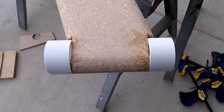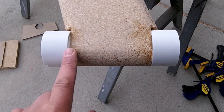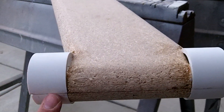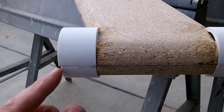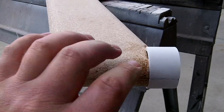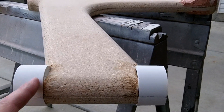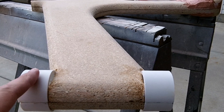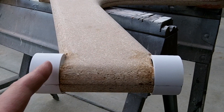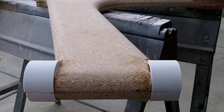I've got the head tubes on there. I've tacked them with just some super glue and accelerator, just on the edges and on the inside. You can see it lines up really well — I got a little off when I was cutting it, but that doesn't really matter. The reason I'm extending these up is because when I lay the carbon fiber in here, it's going to have a real difficult time turning to 90 degrees. So I'm extending this so the carbon fiber can come over in here. When we go to shape the body after it comes out of the mold, I'll go ahead and cut these down so that they're correct.